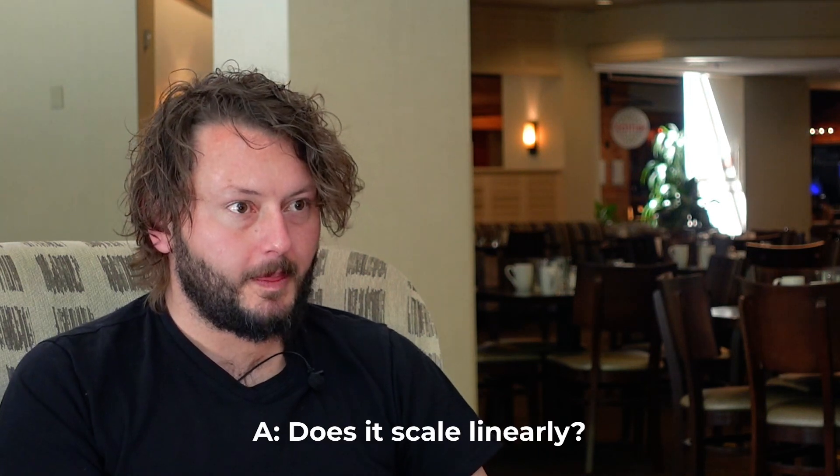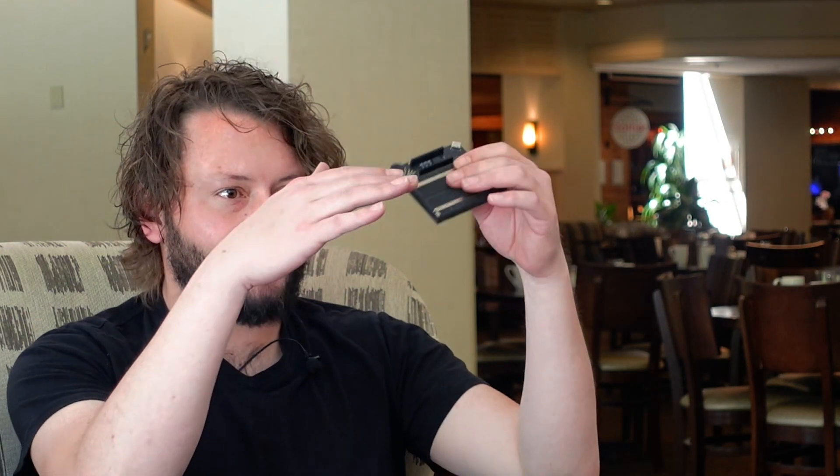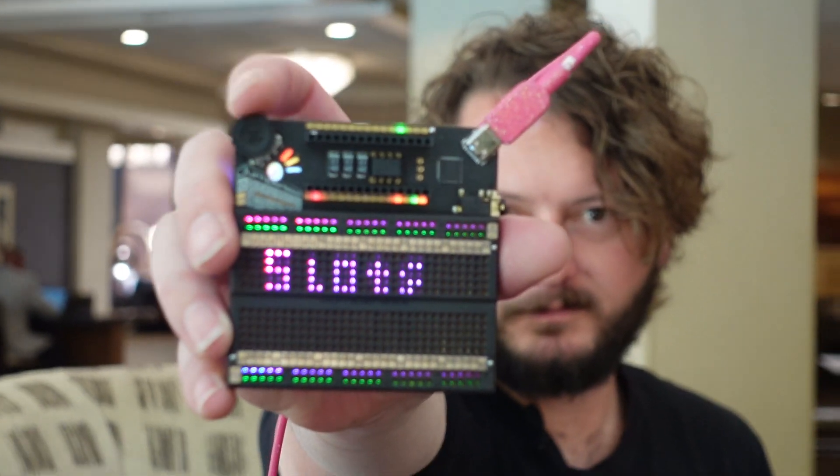Everyone wants a full-size breadboard — that's a really common question. But the math is such that it would go up four times in cost and no one would want that, because it needs more connections on the backend than even just a double. It scales quadratically — it's a square-cube law. The nodes are like the skin of an animal: if you have twice as big an animal, it has four times as much volume. The compromise is that these have 14-pin daisy chain headers, so you can stick two of these together side by side and plug in the leftmost one. You can send eight analog connections and power over to the next one.